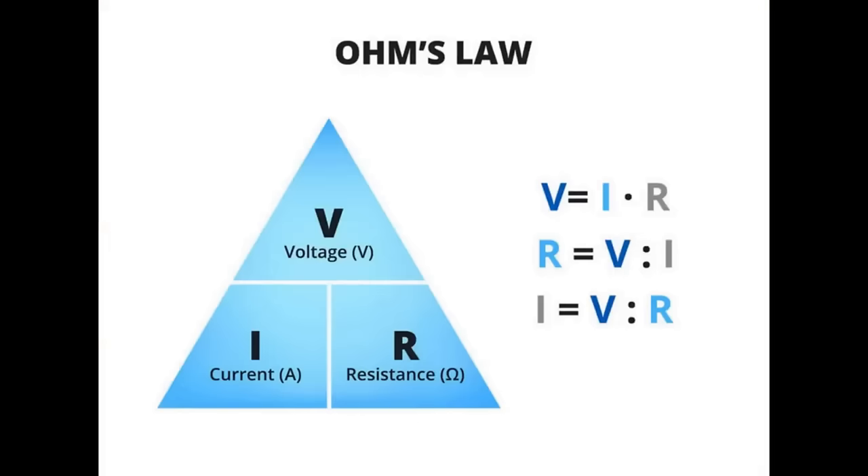With a fixed voltage - say 12 volts and a 10 ohm resistance - 1.2 amps will flow, creating heat, and it'll reach some temperature you can measure. If that temperature is too much, increase the resistance and the current and temperature will drop. You can control it just by using V equals IR with a little experimentation, though temperature has a mild effect on conductivity at low temperatures.